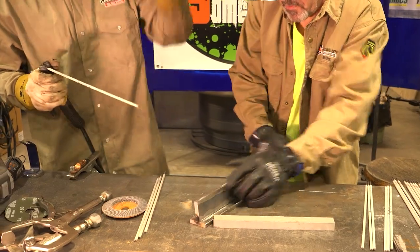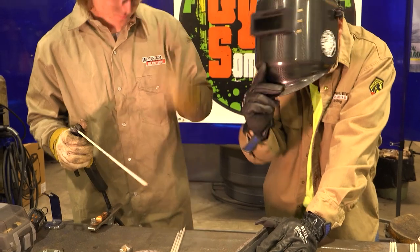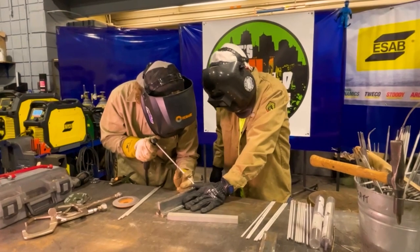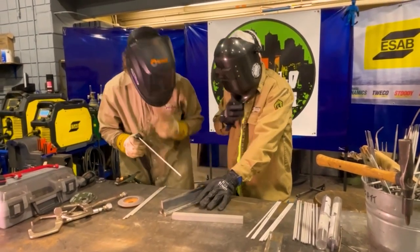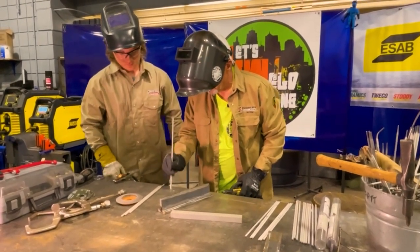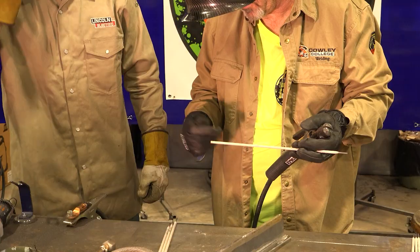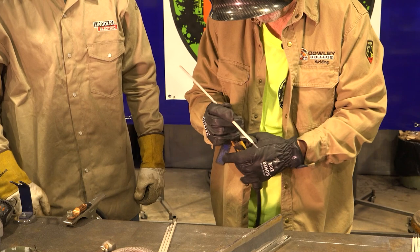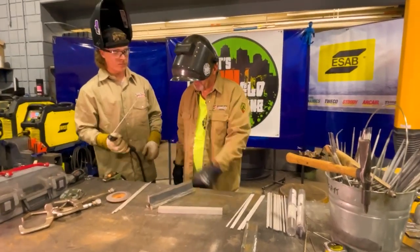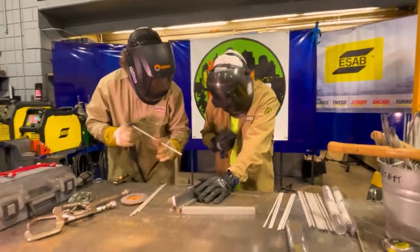I'll be your fitter. When you get through welding with a 7018, just tap it flat because when that solidifies it builds that glass thing on the top of it. Try not to destroy your flux covering. The other thing you can do is have a file handy and just tap it or scratch it on the file — it'll take that stuff off where you can strike it.